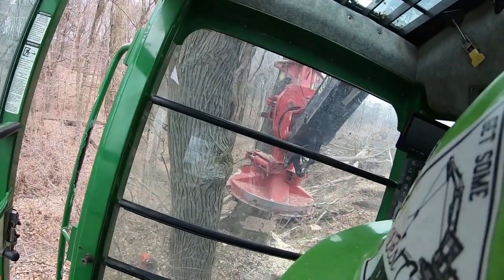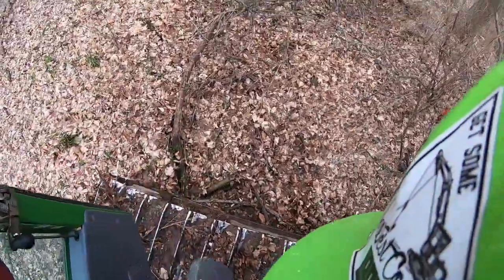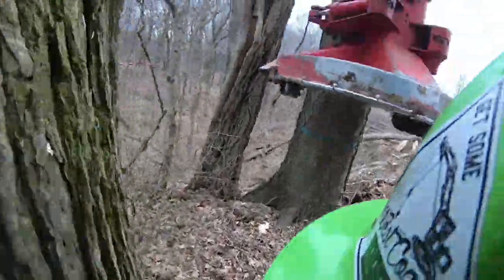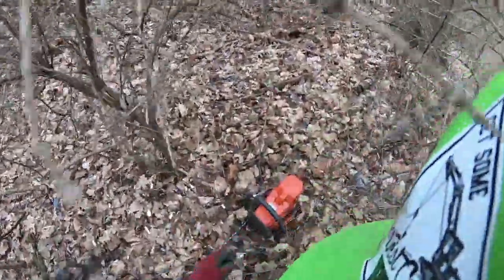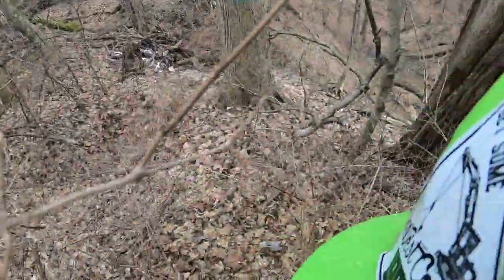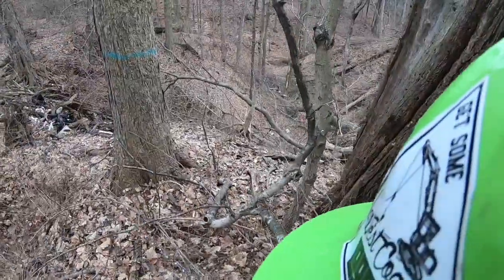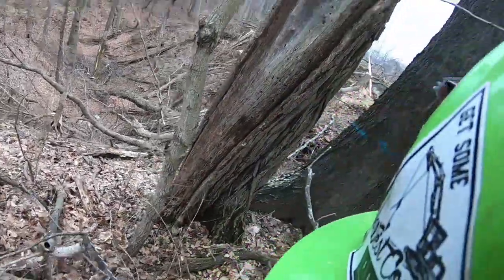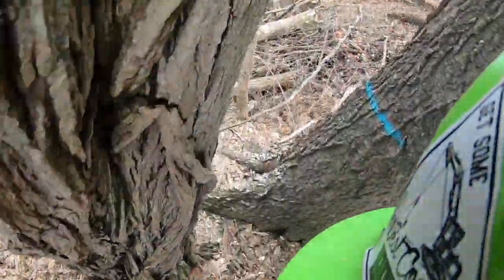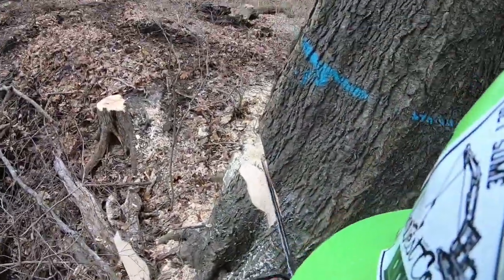It probably ain't going to be Tiger Cat good, but it'll be pretty daggone plenty good enough for us, because the motor's there. And I've been reading on the Bosch hydraulic pump back there, and I think I know how to adjust it where it puts a little more load on the motor. I'm going to check the motor load and RPMs and stuff and see how it don't lug down a bit. It don't try. It don't push. And I'm gonna have to check pressure and stuff. Long story short. But anyways, I'll shut up and we'll put another triple hinge on this other side.